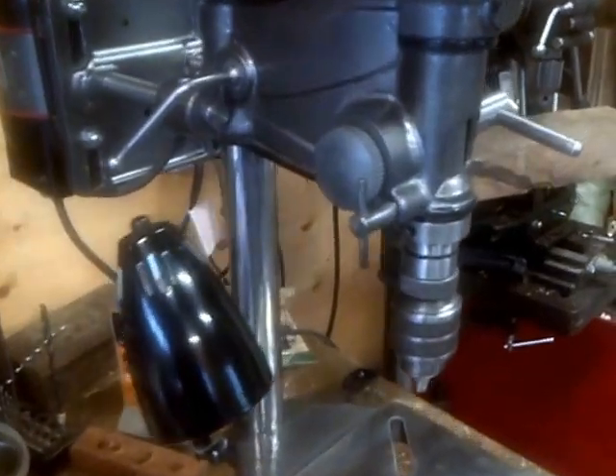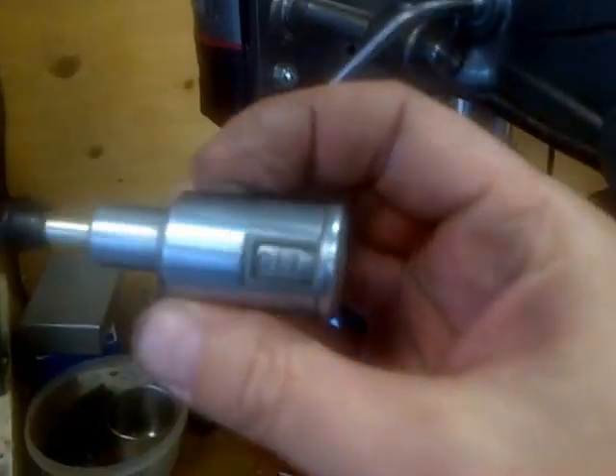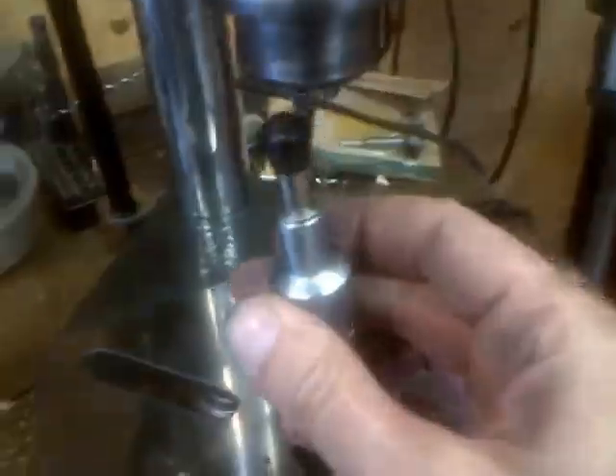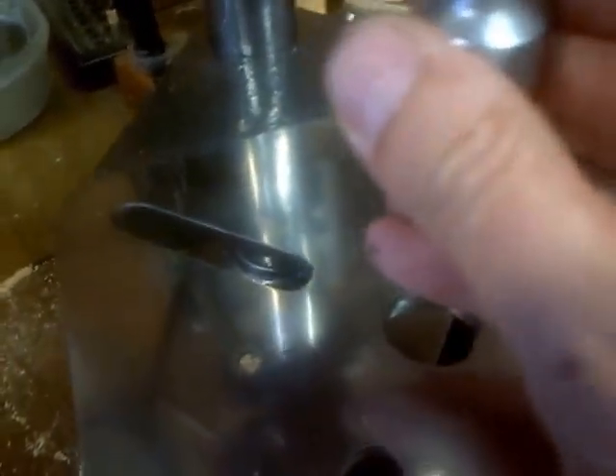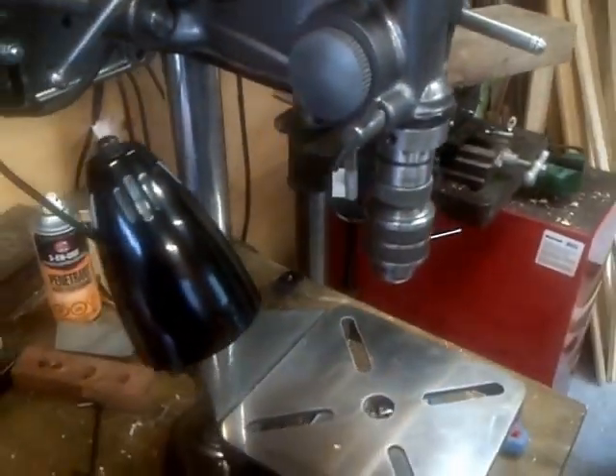So here we go, we're at whatever speed it is now. I could probably do a speed test — I'll do that in one second. So that speed is: I used my little gauge here. I stick that up here, press it in, and I held it for 15 seconds and it did 26 RPM in 15 seconds. So that would be about 104 RPM from my little drill press. That should be good to handle some slow speed.